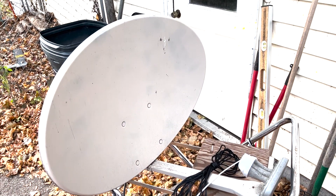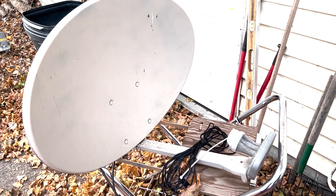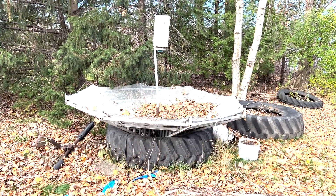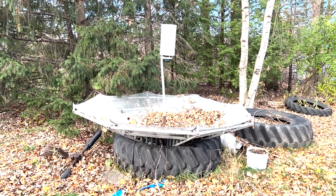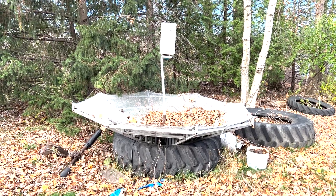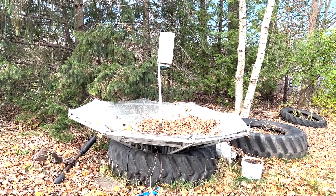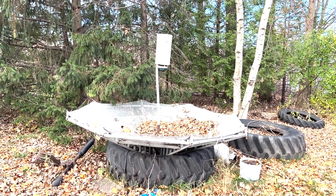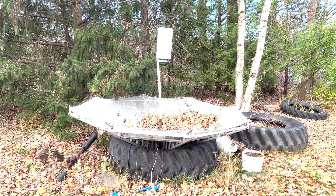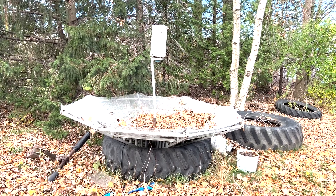This is an interesting item also at Shamrock Banks Observatory — it's called the Itty Bitty Radio Telescope. It's a repurposed dish antenna and I use it to detect the sun and satellites in orbit using a satellite finder. While the Itty Bitty Radio Telescope is a nice demonstrator of how radio astronomy works, this is actually called the Small Radio Telescope, being set up in a drift configuration looking straight up towards the zenith. It's a repurposed C-band satellite television antenna. I'm going to be replacing the feed horn with one sensitive to the hydrogen band at 1420 megahertz. With this I'll be able to see the arms of the Milky Way pass overhead and other radio sources in the solar system and beyond. This is a project for this winter as the weather gets too bad for visual astronomy.